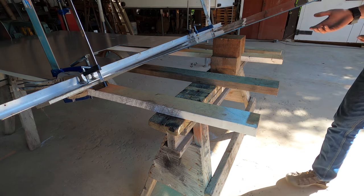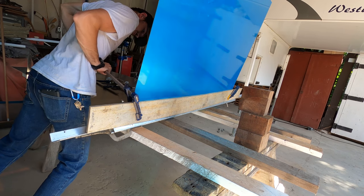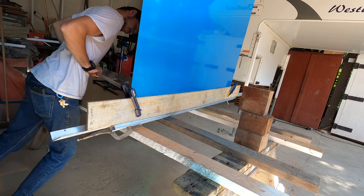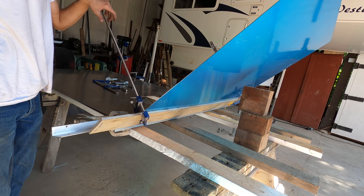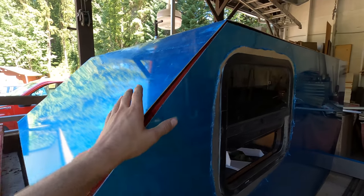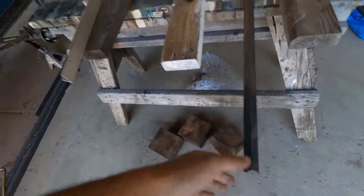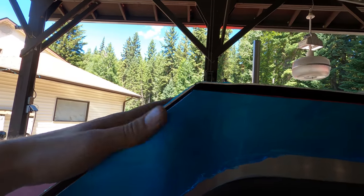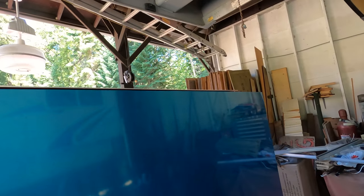Now you just made a manual brake. I had to bend this a little bit more — I had to hammer down on top. I stuck a piece of three-quarter inch angle iron right here across and then hammered on both sides to get it to sit flush. Once I get the angle aluminum screwed in, it should hold nice and tight. You can always use the hammer to persuade it a little bit more, but it's sitting flush so I'm ready to start putting the corner moldings on.